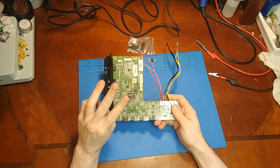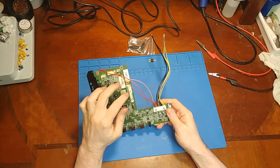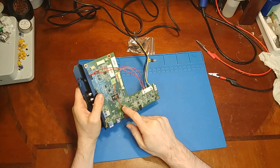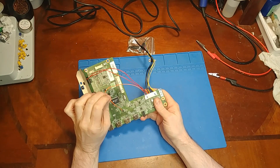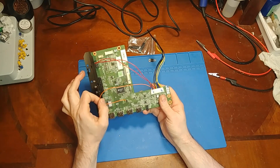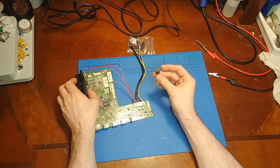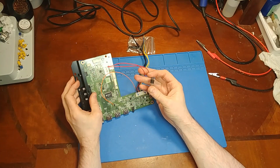This main board needs three power rails to work. It needs 3.3 volts — this orange wire here — and it has its own 3.3-volt regulator, so I'm just stealing off of that. There's the AC-on wire, kind of the 'everything is okay, go ahead and turn on' signal wire. And then there's the 5-volt rail — the red wire — which I'm going to run using a 7805 voltage regulator. These are usually good up to 1 amp, and I think I only need about 200 milliamps.